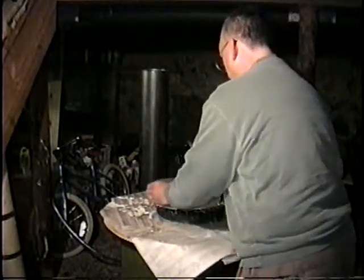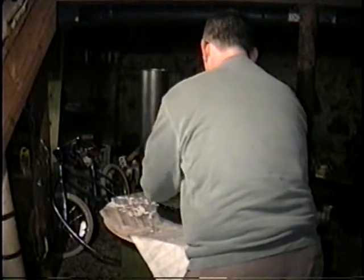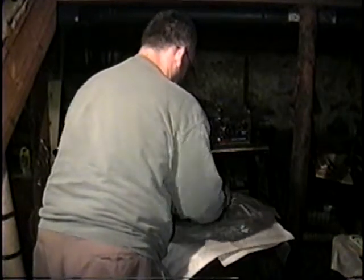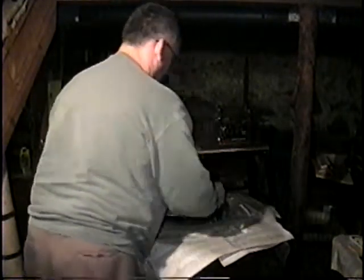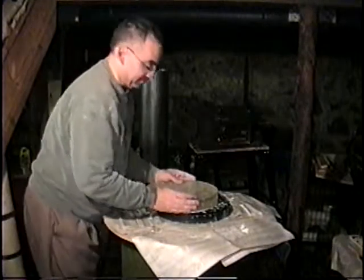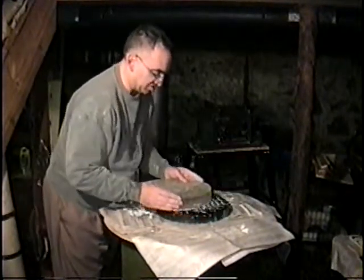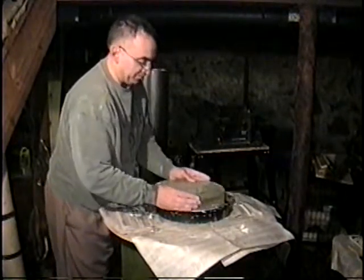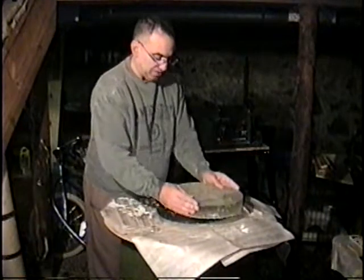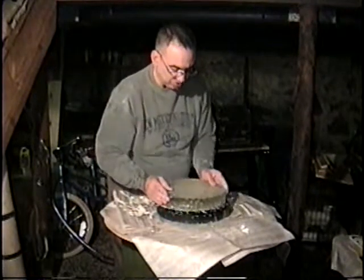And after the end of an hour or two, I'm going to have what I call a flash polish. It's going to look good until you look at it under a light source with a magnifying glass and you see that actually the edges of the mirror are going to be a long ways from being polished out. But it'll get out a lot of the real small pits and you'll think the mirror is fully polished out. It's not. And if you were to send it out to be aluminized at that point, you'd be very disappointed with your results, because the mirror would come back aluminized, but it would be just barely recognizable. The edges would be really very gray and non-reflective. And you really wouldn't have a very good mirror.